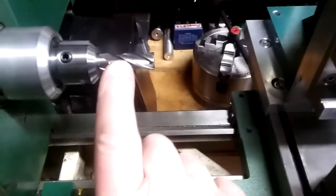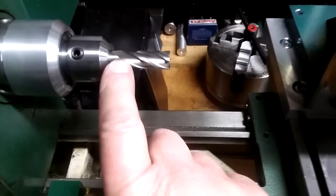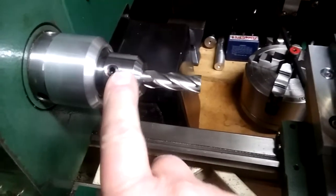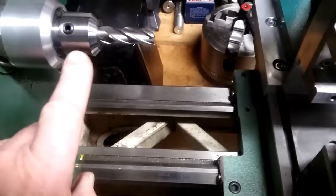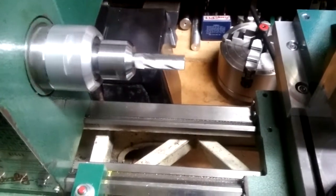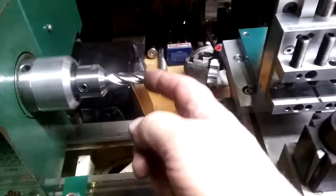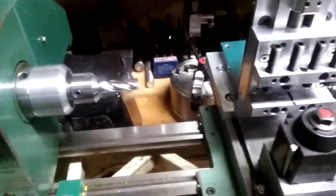But then I got to thinking I'll mostly be using 1/2 inch cutters or cutters with a 1/2 inch shank. So I built this myself out of 4340, and it's really short and stout and runs perfectly true within a 1/2 thou anyway. So that's what, in my next video I'll have the attachment looking this way, and I'll be milling on a part so we can see how the thing works.